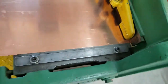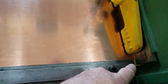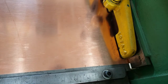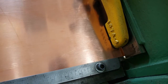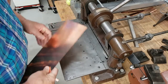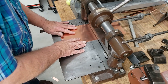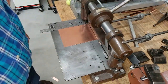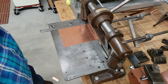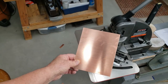I am going to use my treadle shears to cut the piece of metal, at least make the first cut. I will place the mark on the sheet by the edge of the blade and then step on the shears and it will give me a straight cut. By aligning it with the stop on the side and knowing that the rest of my sheet is square, I will get a straight cut. I am going to go over to my one foot lever shears, slide the metal into my mark, and use the shears to cut my bottom and side pieces. I now have a piece of metal that I am going to make the bottom and sides of my box out of.